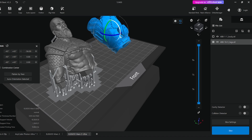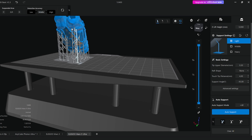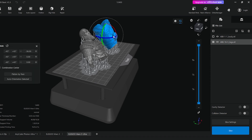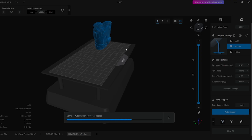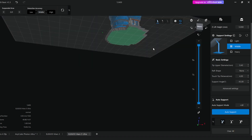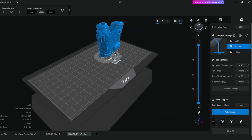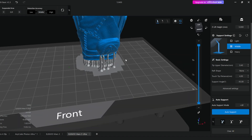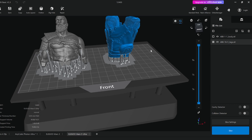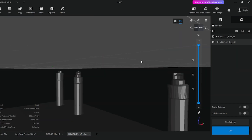You can go with your 35 to 40 degrees, and then you'll have your supports here — but again they could leave little marks when you take them off. For something like this I would actually go almost 90 degrees. You can see all the supports are in the section that's mostly where you're not going to see them on the miniature. If you're doing a really large piece and printing it like this, you might get the suction issue again, but for something with a little area like this, it's not going to be as bad. That should print quite alright, though doing it like this does put in a lot of auto supports.